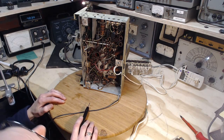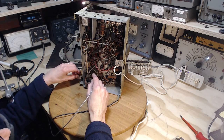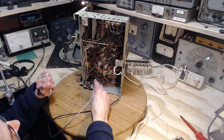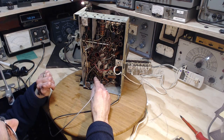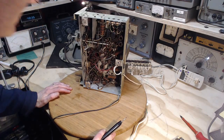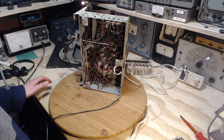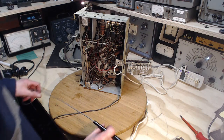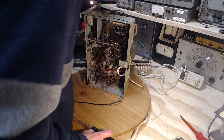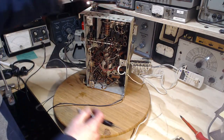And on the other tube, pin 5 could be here. I have the volume right up full here. So no, I don't. Now I got it up full. Let's go back. Pin 5. 1, 2, 3, 4. Not a thing. Ooh, okay, this is not too good here. Speaker not getting hot. What is getting hot? 136 watts of heat being thrown off by this guy. There's an awful lot of heat coming up from that rectifier tube. Somewhere there's a lot of heat coming.